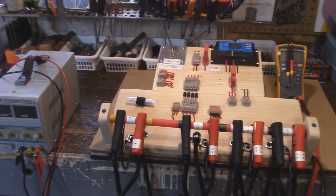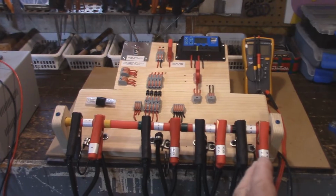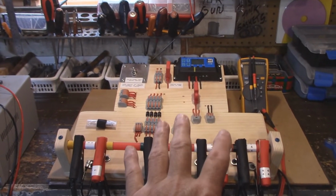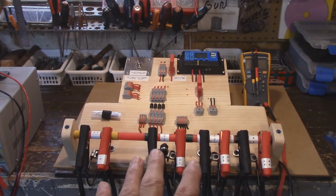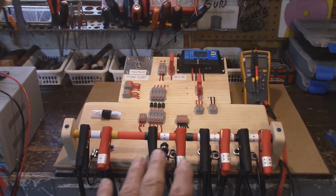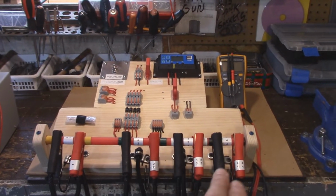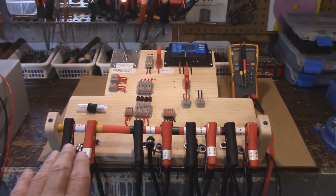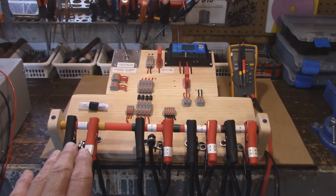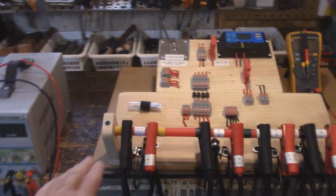So now, what I'm going to do before I start anything is I'm going to explain to you that the best practice is if you have one power supply, you can't just hook up 4 sets of cables to 4 different batteries, because they'll all draw off each other and they will not charge correctly. Now, all these cables are independent. They don't actually interact with each other ever. They're just completely separate at all times, except these 2.